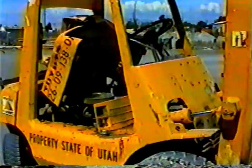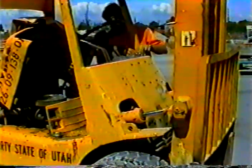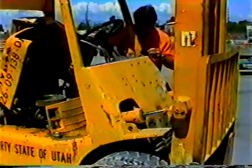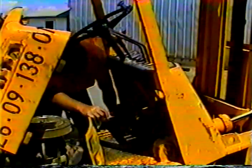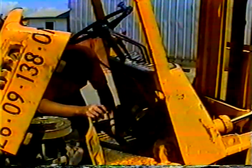On this forklift, the brake fluid reservoir is on top of the dashboard. If you can feel oil inside the reservoir, you have enough. Next, the transmission fluid — the reservoir is under the floorboard. Again, keep the level between the full and add marks on the dipstick.